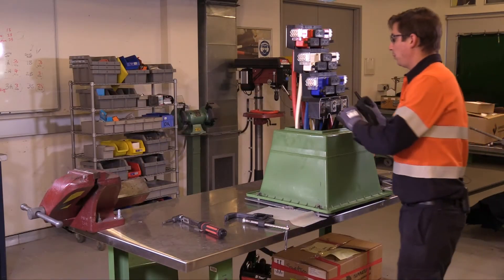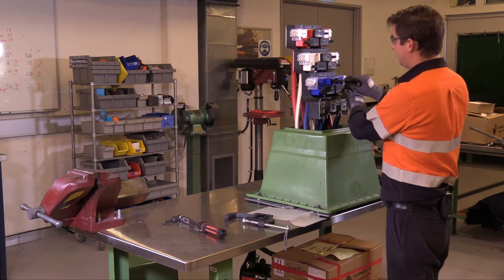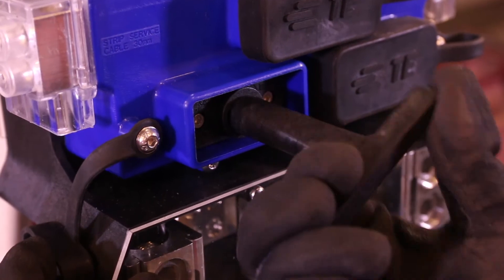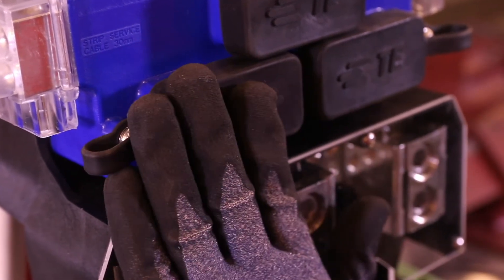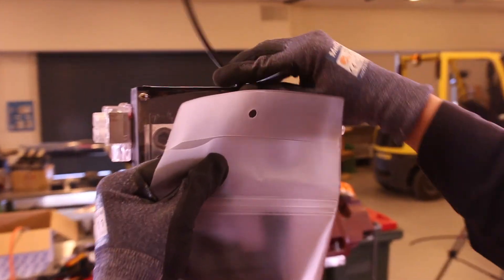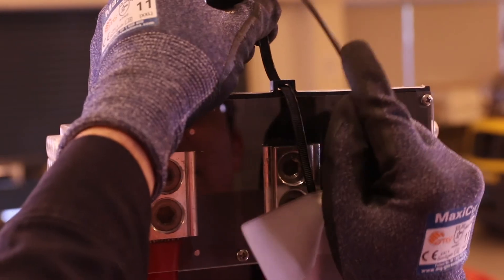The links can now be withdrawn and put in their bag for later use. The operation of the link is exactly the same as all prior-style tappet links — by inserting a key, turning anti-clockwise and removing the link. Zip-tie the bag through the available lug at the top of the unit, which is a new addition that now keeps all the links dry.